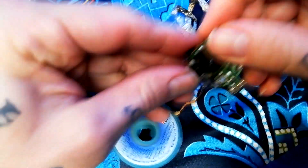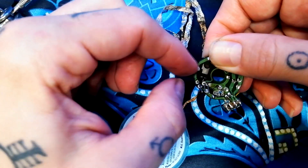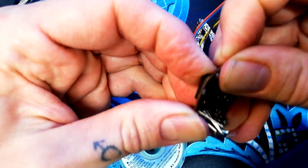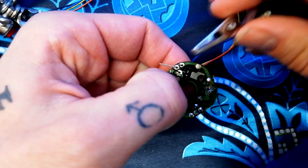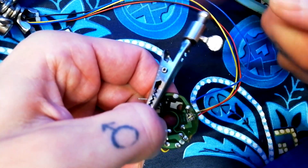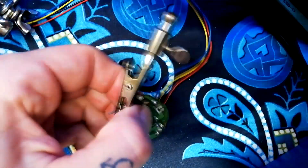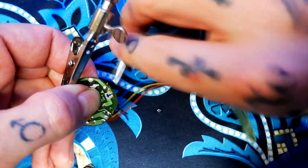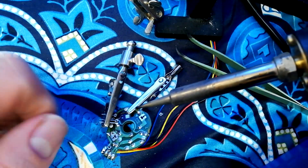I've inserted the pins of the new motor control chip through there. I want to get it laid out in such a way that the metal plate at the back is going to have good contact with the brass spring when I remount this PCB inside the motor case. Because integrated circuits like this are pretty delicate, you definitely want to ensure there's some sort of heat sink on the pins when you solder them, so I'm going to attach this bit of my helping hand to these pins to dissipate any excess heat. I'll solder it like that and then trim the excess pin after I've made the joint — even with the heat sink in place I don't want to be heating it for more than a second or two.